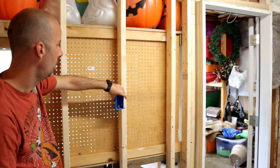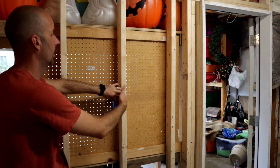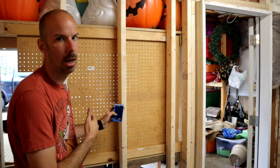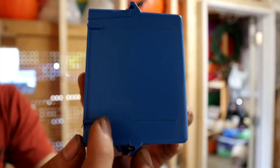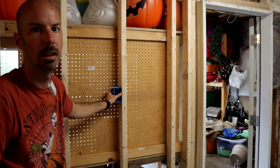When you're mounting these to the wall, you don't want it flush with your joist because when you go to lay your drywall it'll be recessed too far back. Everybody's afraid to do this part - once the drywall is up you can't pull it all down to readjust. But these things are helpful: there is a little notch right here, and that mark is so you set it against your stud before hammering it in. Let me bring you in closer so you can see exactly what I'm talking about.